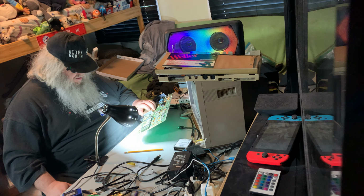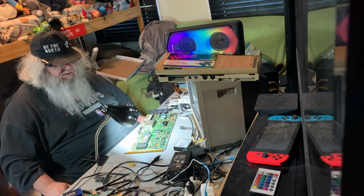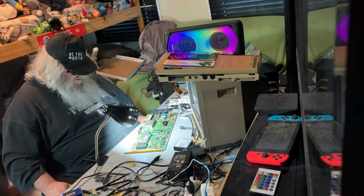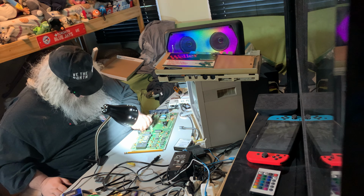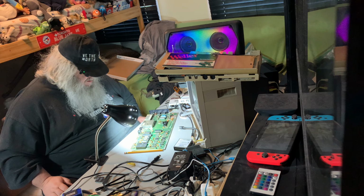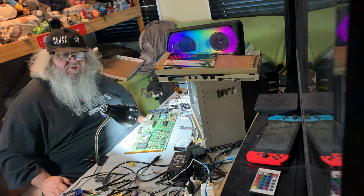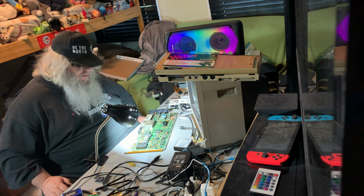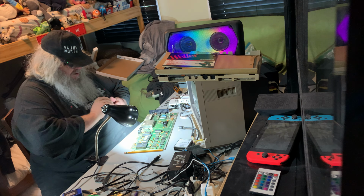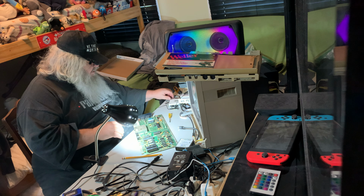So the ports are clean. If I had the DeoxIT here, do I have it here? No, I guess it's downstairs. I would probably just, and I'll probably start just doing this routinely, spray it into sockets and into connector things, because you never know. See, we're not dealing with a whole lot of voltage, and so micro corrosion happens. It does.